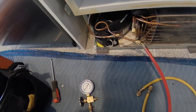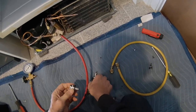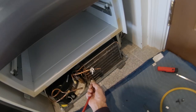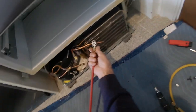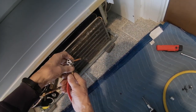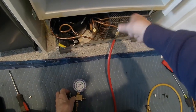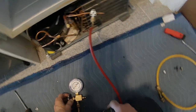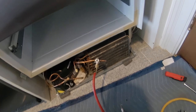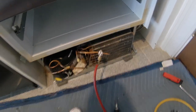There is no gas in here. I'm putting this valve on the high side here to see if there's any freon in here. If there's no freon in here then we may have to go check the evaporators. There's no gas in here, so it's probably not the switching valves — it's probably an evaporator.